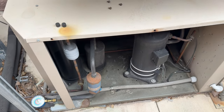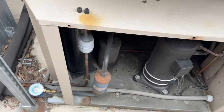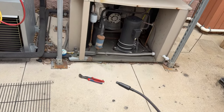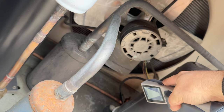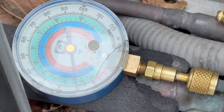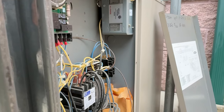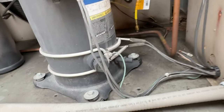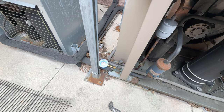I'm gonna grab the leak detector and see if we can find the leak. Let's go ahead and turn it back on - that's not shutting off, I guess we're just passing enough refrigerant through to make it work. We've got less than 10 pounds of pressure to find the leak - that's asking a lot. Usually it's that stupid cap. I don't think we've got enough pressure. Why are the fans... oh, it doesn't have a fan cycle control, just a headmaster. Let's check the oil level - and you can see there's barely any oil in there. Do we pump it up with nitrogen or throw some refrigerant in it and hope for the best? That's one of those judgment calls.